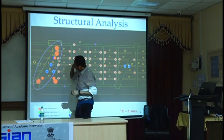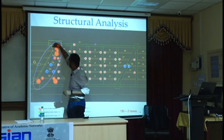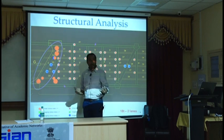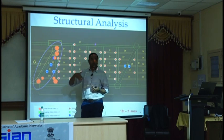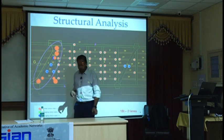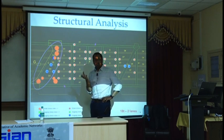The way they cut out is they hydro demolish the whole area alongside here — expose the steel, put scaffolding below it, and pour new concrete back in. There was a lot of discussion at that time because it is an 80-year-old structure with an average strength of 20 MPa or 19 MPa. The question was: what repair material would you put in?